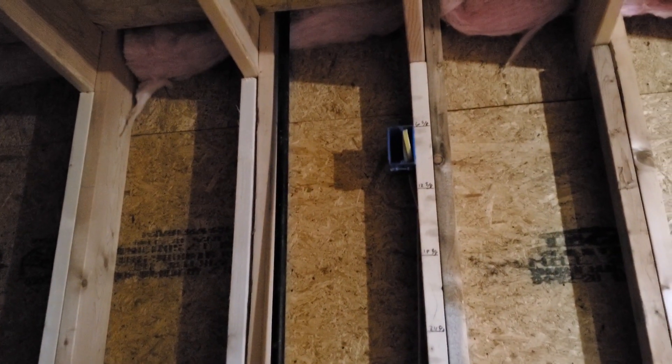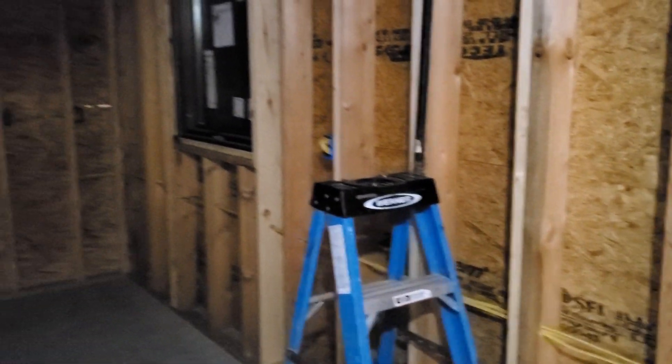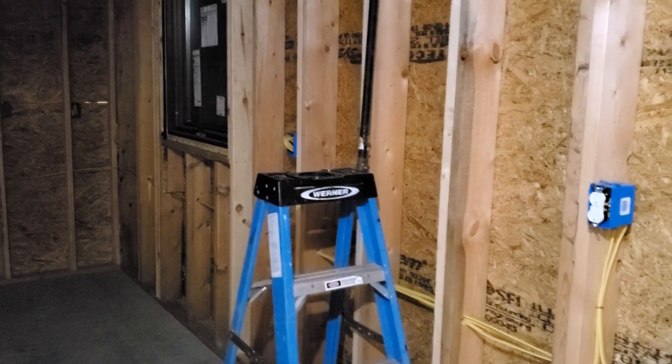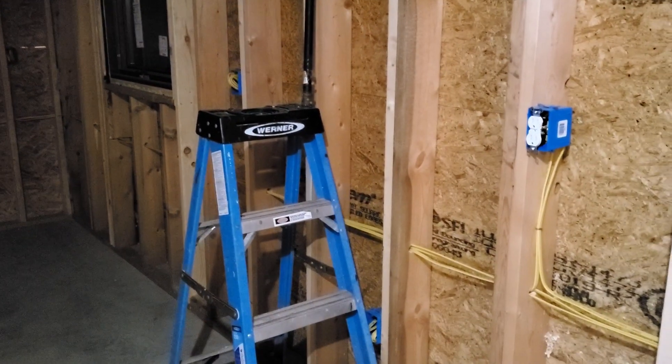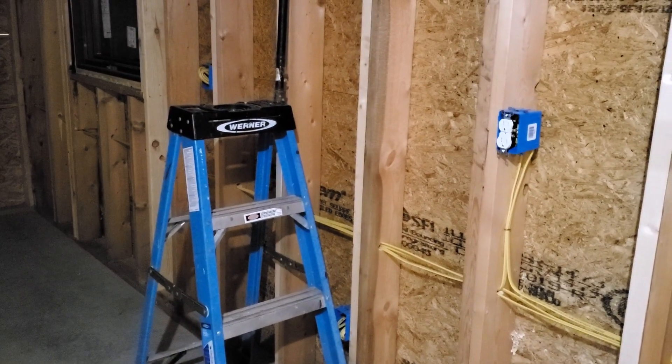It'll come over into the craft room — I just got done drilling my hole in the top plate. Here's my pipe coming down. This pipe doesn't hook up to anything yet, it's just there for reference. That's a 10-foot pipe and I've got to put another 2-foot pipe below it, feed it through my hole, then tie that in, and that will complete the gas line for the craft room. This is where the oven goes.